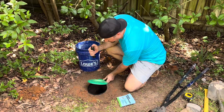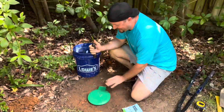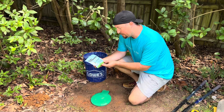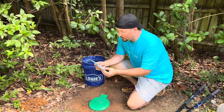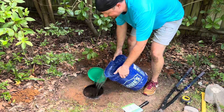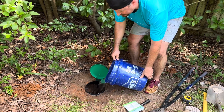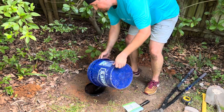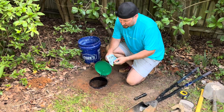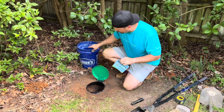We're all filled back in and you can see it opens very nicely, going down to our really deep hole. The trick to this system is these Waste Terminator tablets, which they say are non-toxic to people and pets, and harmless to lawns, pets, and plants. According to the instructions, you fill it with water, then add a couple of those tabs. The tabs contain enzymes that help break down all the waste you're putting in there. You can add water periodically. I'm not sponsored by this company, so this is my first time trying it out. We'll use it for a while, then come back in a couple of months and see how it's been doing with the smell and breaking down the waste. You can use it with a hose or a bucket.